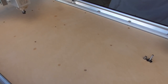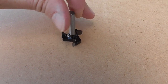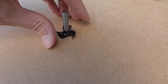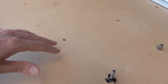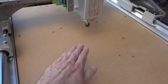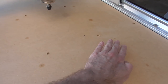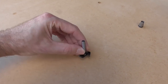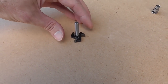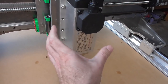Next job is to use this one-inch Forstner-style surfacing or planing bit to surface the wasteboard. I'll do small areas first and check for tramming issues — if the surface goes up and down like that, it means the bit is cutting at an angle as it moves rather than vertically, and you'd fix that by adjusting the mount bolts. I don't know how much I'm going to worry about that for now, but I'll start with a small area and check.